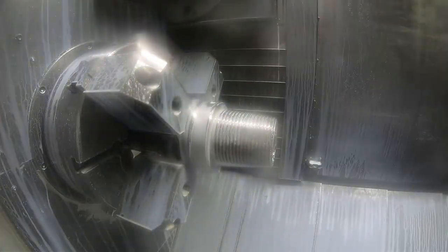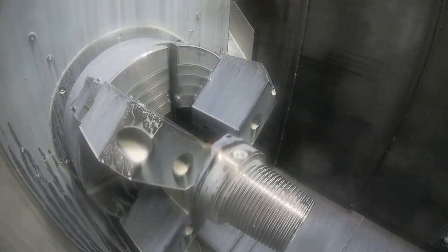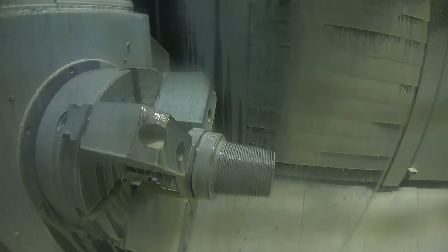There's a spot drill, the chamfer for the thread, I should say, and then I also put a spot for this face, this spot facing tool. It only goes 50/1000ths deep with the half inch end mill. And then the 5/16 drill, tap drill for a 3/8-16 thread. And then the thread mill. Had a little difficulty getting any kind of video on this because the high pressure coolant is totally blocking the video. There were little sections of video where you could see the tool, so I cut everything else so you could at least see the tool once in a while. But it actually takes a little bit longer than it appears here to cut that thread.